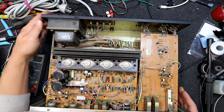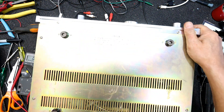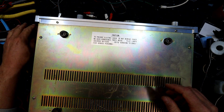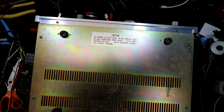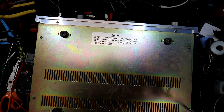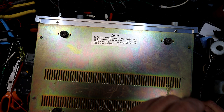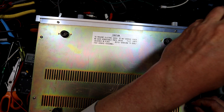I guess I probably should, before I do anything, check those output devices. Looks like the whole bottom comes off just easily enough. There's an oddly blown fuse and something's going on — there's probably going to be DC on one of the outputs. Someone would have no doubt tried another fuse in it, especially someone who had a collection of this audio gear. At least it doesn't look like it was just a technician that had hoarded write-offs.